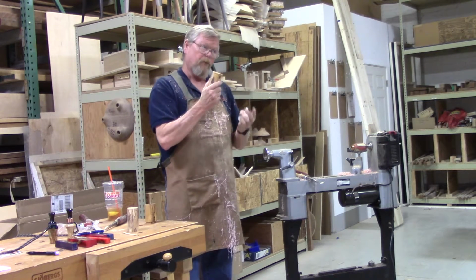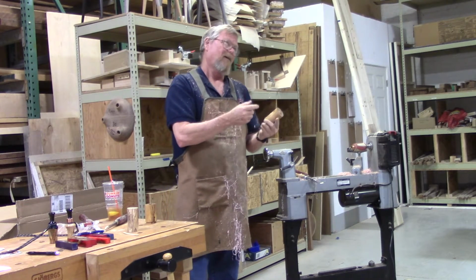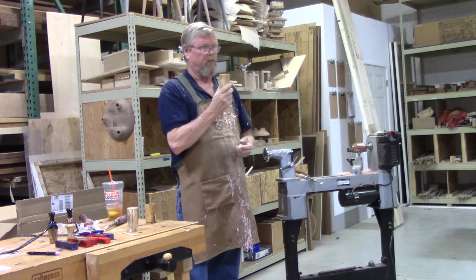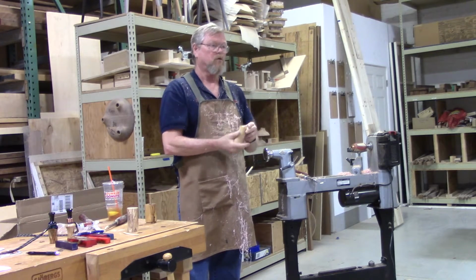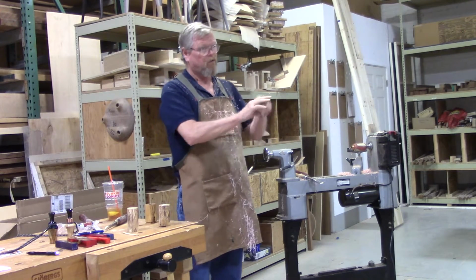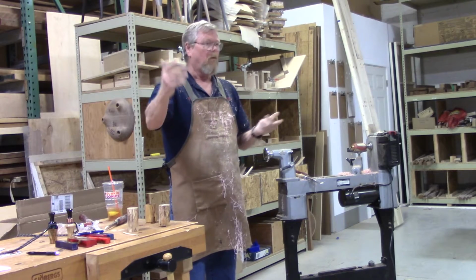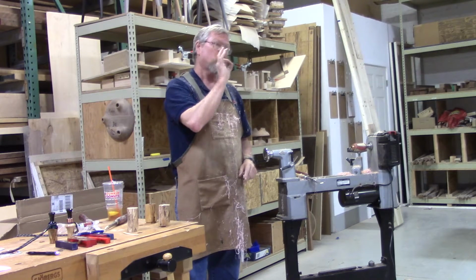Now, the instructions that I got from Seebeck, his last name, thank you. From his instructions, after I'm done vacuuming this stuff, I let it sit overnight, submerged, and it just gets total absorption. I mean, that's hard. Next process after that, you get it out of the tank, you squeeze it all off. You get aluminum foil. Here comes the toaster oven. I got it at Walmart. You wrap it in aluminum foil, put it in the toaster oven at 200 degrees.